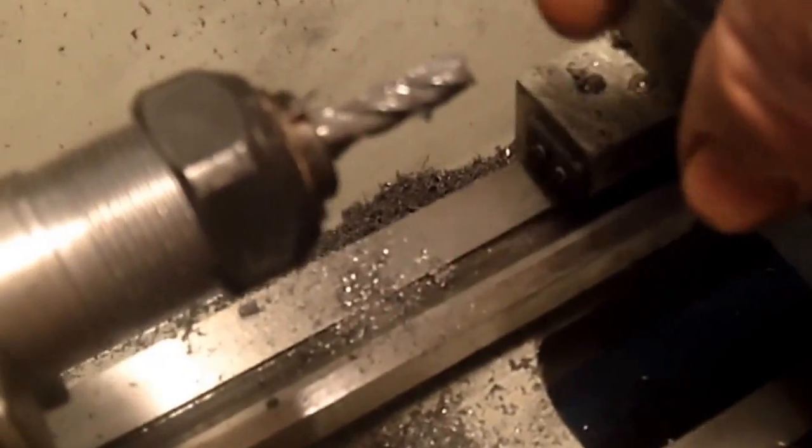It's an extremely tight keyway — I checked it with the calipers. I milled it down so the max across the entire shaft is 1.125 inches, which is 1 and 1/8, exactly what it should be. The shaft should be one inch and the keyway should be sticking out about 1/8 of an inch.